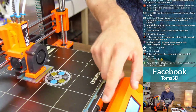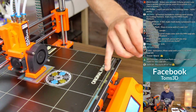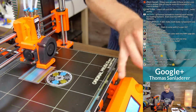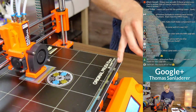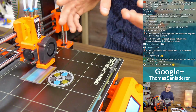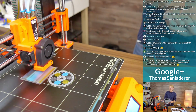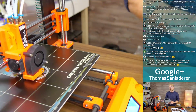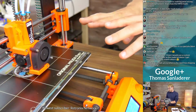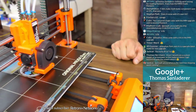So you can actually see that this is extruder 1, 2, 3, 4. There's a bit of material right there for 1. There's very little for 2 and 3, and the 4th one has a lot more material. So I'm just thinking these filaments weren't all loaded to the exact same length, and this just evens that out. It just extrudes a bit, it purges a bit. It managed to get the length of the filament synced, and then it went to printing.